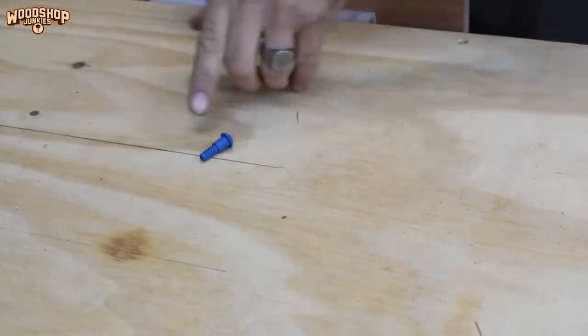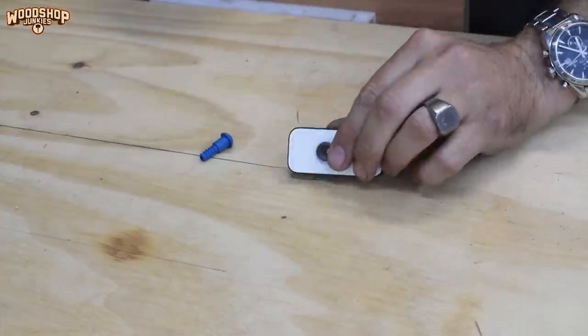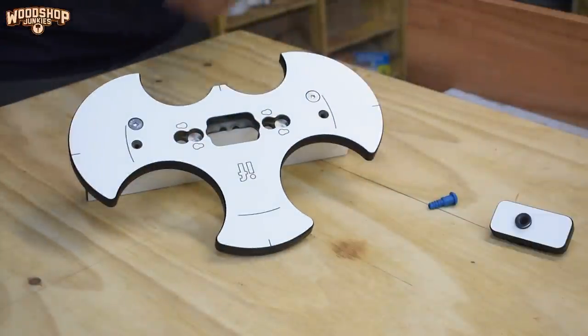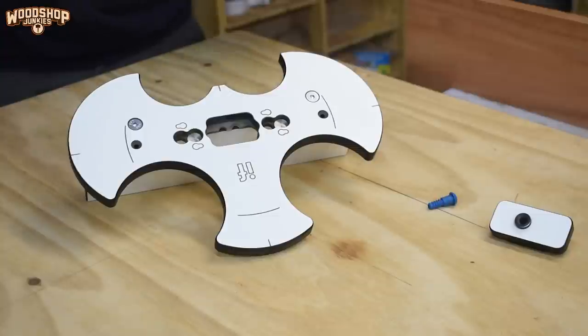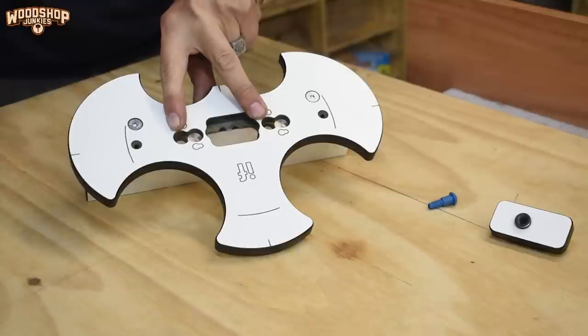And to install the peanuts, they need to be seated into a 6mm hole, similar to a dowel hole. And I think that's why the 6mm drilling bush is included in the basic set. As for the technique, we're going to use the jig with the bush insert exactly the same way as we did with the dowels, except this time it is very important to note the orientation of the gravity stops. We are either going to pair these two or these two holes together.